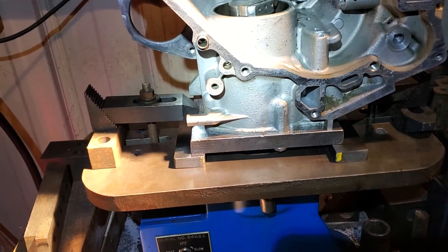That's a pretty sturdy setup — I don't have any trouble with the cylinder or block moving. With the torque plate, everything bores and hones like it should, mimicking having a cylinder head on there. So when you torque the cylinder head back on, it should make everything round. If you don't use a torque plate, the block is suspect to pulling and maybe not having a round hole when you torque your head back on. So that's my advice — stay tuned.